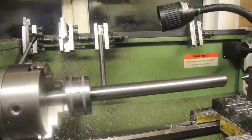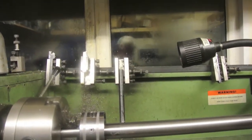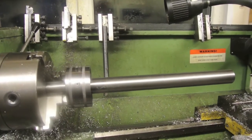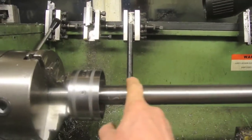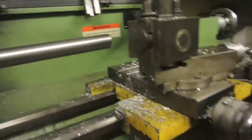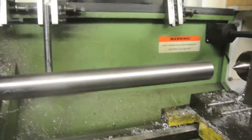One of the first things I noticed that is different between the draw tube fitted to the rapid turn versus the lever action collet closer for the Slant Pro is that the OD on the tube itself is very slightly larger, and it won't actually enter the spindle on the rapid turn. So I'm going to have to machine this down so that I can fit it through the spindle.